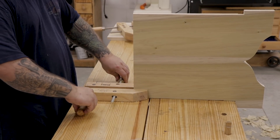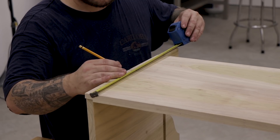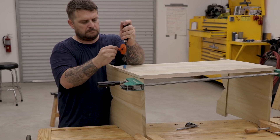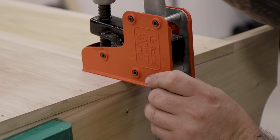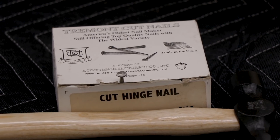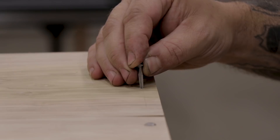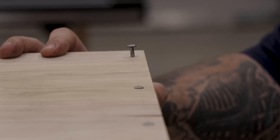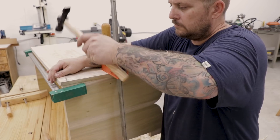Now I'm ready to start assembly. I need the end panels up on their sides, so I'll use wood screws to hold them in place. Then I can install one of the side panels and start laying out where I'm going to nail it to the end board. The nails require a pilot hole, so I'll use my egg beater drill with a small drill bit. The board developed a little bow, so I'm using a clamp to hold everything tight until the nails are in. For the nails I'm using cut hinge nails from Tremont — they're wider in one direction, which requires them to be installed with the wide section running with the grain so the boards don't split. The swell in the middle of the nail body also gives more holding power than a wire nail.